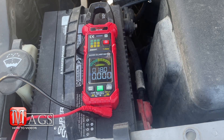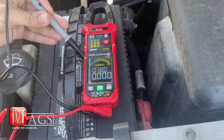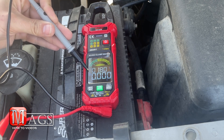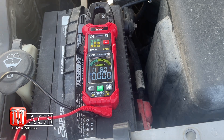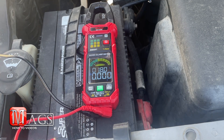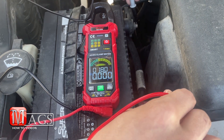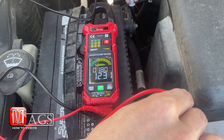For this next test we're going to be testing how well this thing measures direct current voltage. I already have it pre-selected on volts and it says DC. I already tested it with another multimeter and that one read 12.3 volts, so let's see what we get here — we're getting 12.3, 12.31, so that thing's pretty accurate.